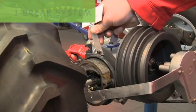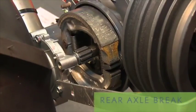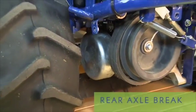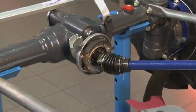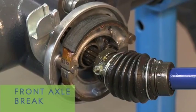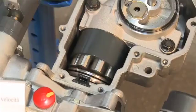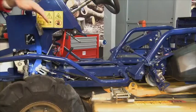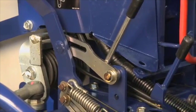The CMX four-wheel drive Razorbacks have serious stopping capability. The rear axle has a double shoe drum brake, as does the front axle. When these two brakes are applied, the hydraulic brake also comes into force, providing a solid stopping solution regardless of the angle or slope that you are working on. The Razorback is also fitted with an easily activated parking brake.